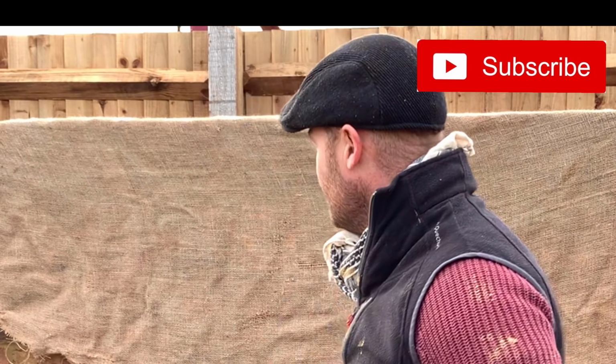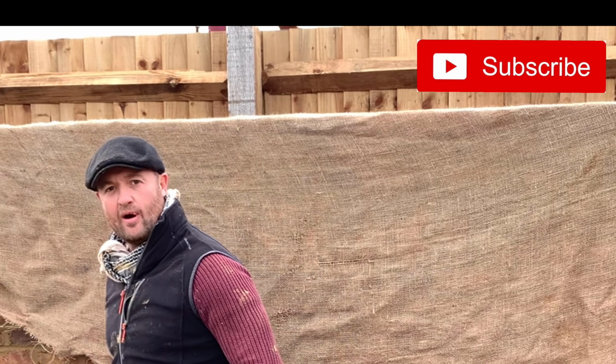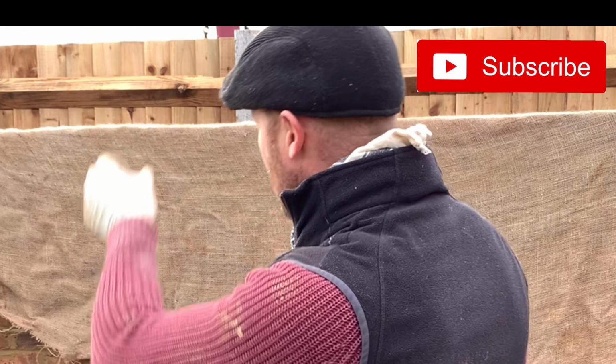I remember we did this, I had the same problem years ago, and what we did is we came back the next day and we got hessian, a big roll of hessian, and rubbed it all round, and you're doing it and you think, oh my god, it's smearing to bits. But when we came back a couple of days later and gave it a stiff brush off, it looked amazing. It just gave it the character, you know. So this brick here, you can imagine, especially if they have all the heating pipes exposed, the ironmongery, it's going to look unbelievable. You imagine all the copper pipes going down, or painted black pipes and stuff.